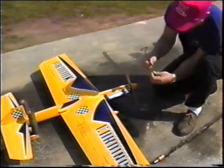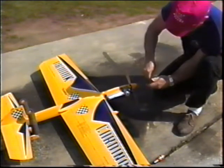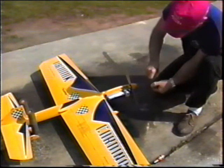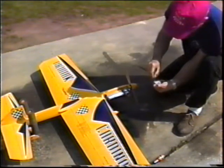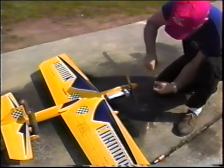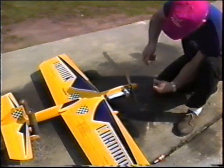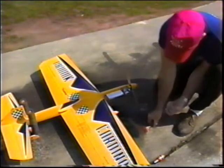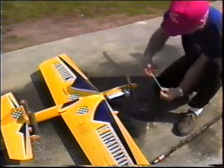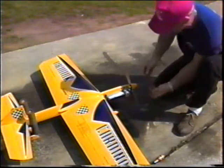What happens when you sandblast it, a lot of times there'll be some sand down in the screws. Not to worry. And it might even be good to run a tap down in there the first time before you try to mount it on a plane. Again, none of these things constitute a real problem. Good idea too to have a set of 440, 632, 540 taps. Real inexpensive investment for doing these kind of on-the-field little adjustments.